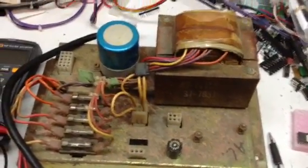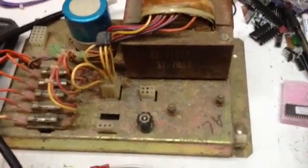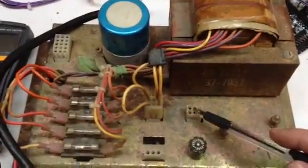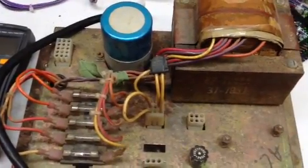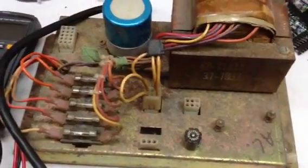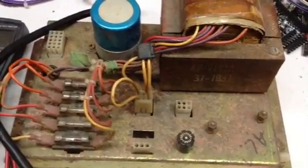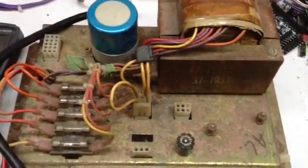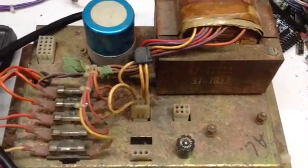The first thing that you need is power. Power is going to come into this plug here. The next thing you'll need is some way to turn this thing on and off. That's going to be controlled at J2. There are a couple of different ways to do it. One way is you can buy a 6-position Molex .093 male connector from any Radio Shack and you can jumper pin 1 to pin 4 and pin 2 to pin 5, and that'll act as your on-off switch.